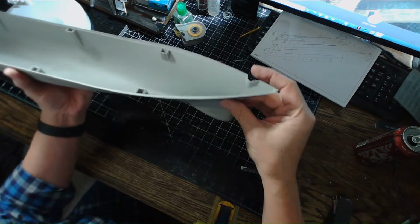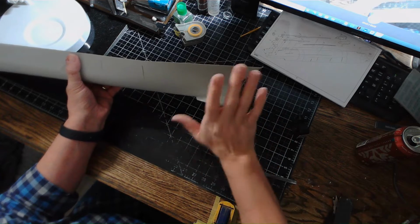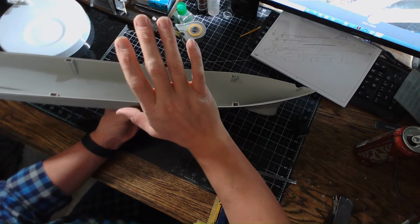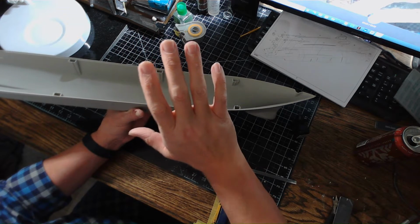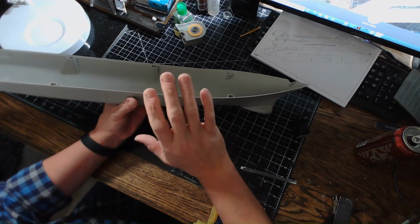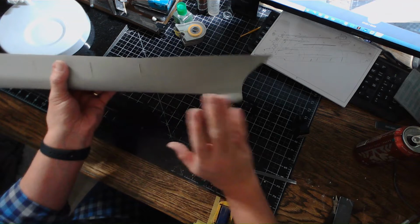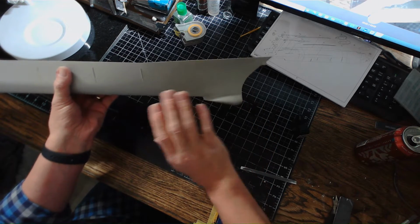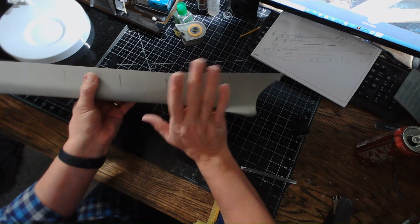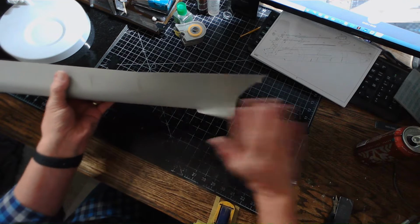The hull is crashing through waves. The skin of this is taking a lot of beating from water. A lot more metal fatigue as the metal heats up and expands, or it cools off and contracts. That's the metal fatigue. And so that causes those stresses in the skin of these vessels, and that's what causes that oil canning effect. So apparently when this model is depicted, allegedly when it's depicted, it's going to be new enough that the oil canning is going to be almost non-existent anyway.